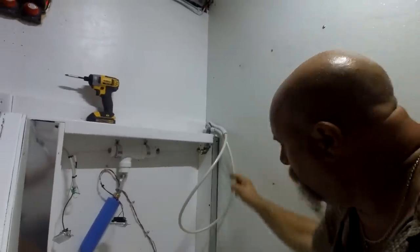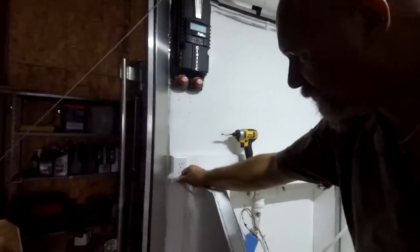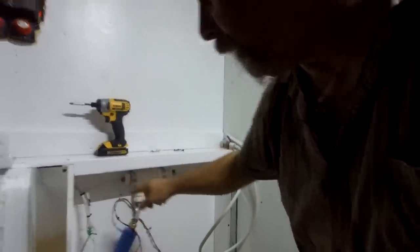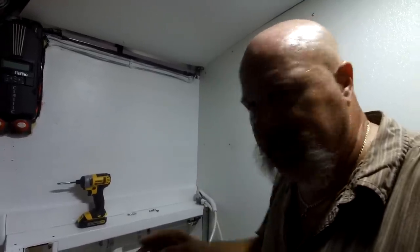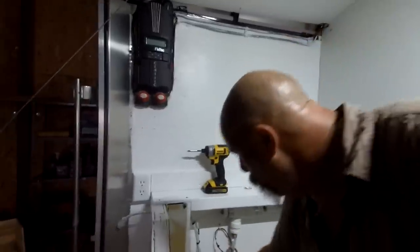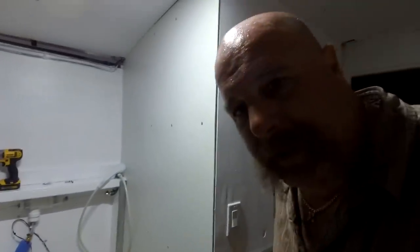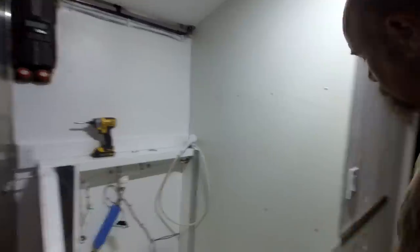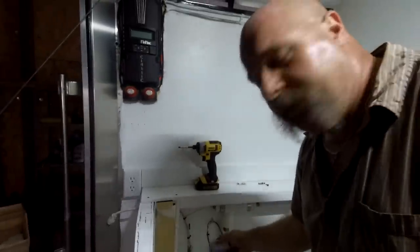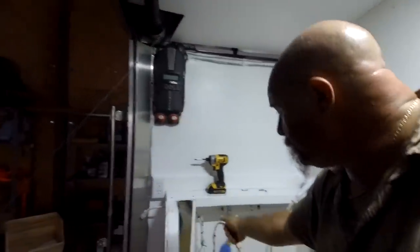The shower head will be mounted up here. Once the water gets to flowing and there's plenty of water in the system, I purge all the air out of the lines. Then I go over here and plug this outlet in — it goes through here to this switch and then up to this here. What about a GFI? The inverter is a GFI — it has a GFI cutoff built in, so I don't have to have a GFI switch out here. I plug that in, and once the water gets flowing I'll turn that switch on. The switch will actually be in this opening right here with a cover on it. They're not waterproof, but water isn't going to get to them because I'll have a shower curtain in between. So I turn the pump on — this should be the switch right here — and it starts pumping water up through everything and it starts coming out the shower head.